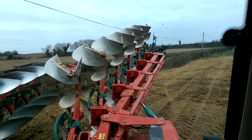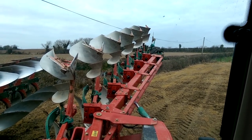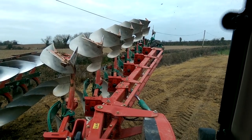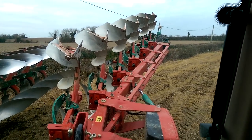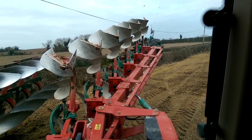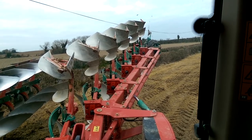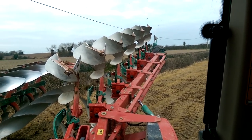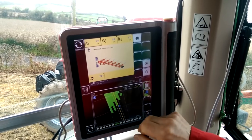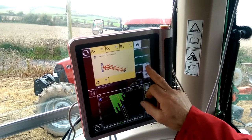By doing that, it means you can put on and off the plough without having to adjust the lift arm in awkward ways. So the plough headstock will align itself to the lift arms of the tractor? Always. Many of us, when changing plough in the past, would have to put blocks or jacks under the front furrow to get it square. Also, there's the ploughing width itself, plus or minus.